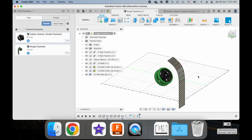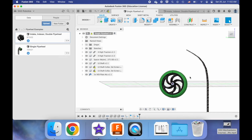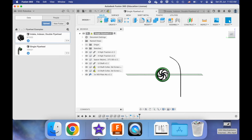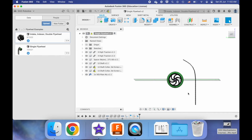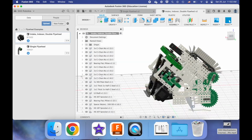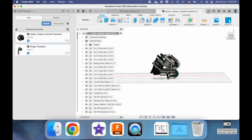Okay. Now, why would you ever use this vertical flywheel system, what advantages does it give? Because it's set up like this and you have a back wall here and you have a flywheel angle at this position, depending on how fast you spin this flywheel, you'll have greater control over different trajectories of your game element. So if you get really good with a sensor, if your programmer is able to detect how far you are away from the target, and you do some physics calculations, or maybe you just do a bit of guess and check to see what works, you could set it up so that this flywheel spins at different speeds depending on how far you are away from your target, and you can theoretically make almost any shot accurately. For this one, it's a lot harder because varying the speeds will vary the trajectory, but because you're not rolling off of a backboard that's curving this way, it's just not going to work as well.